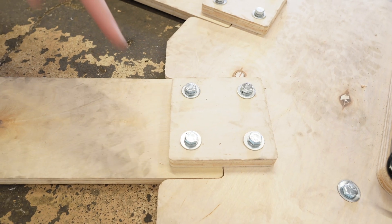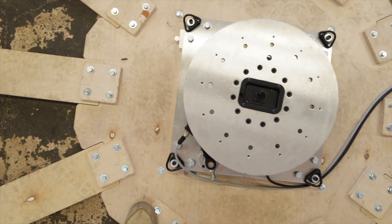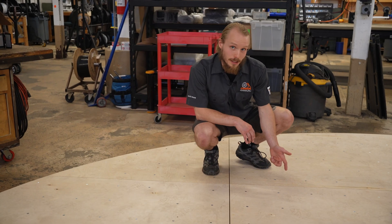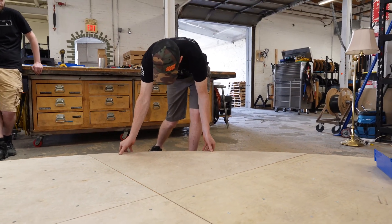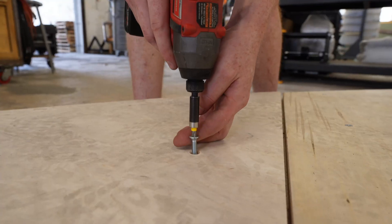The spider has alignment notches in scab plates to locate pieces and fasten together quickly and accurately. Anchor the center of the spider and the pivot to the stage floor before starting to assemble the deck. The turntable deck is frameless — it's composed of two layers of plywood that bolt together with T-nuts and stove bolts. It's incredibly fast to put together and can store on a single 4x8 pallet or plywood cart.